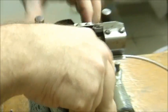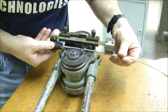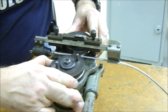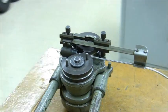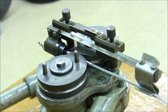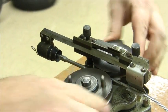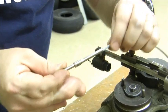To do that, I'm going to spin my dies around to reset them. I'm going to slide everything into position and make sure that the line that was between the two dies is now spaced 90 degrees so that it's going to be properly swaged. I'll set my dies into the neutral position, retract my cable back to where it was, and now we're going to swage it one more time. This time is much easier than the last, but that pulls everything through. Two passes is all it takes — spin my dies to release the cable, pull the cable loose, and we have a professionally swaged cable.